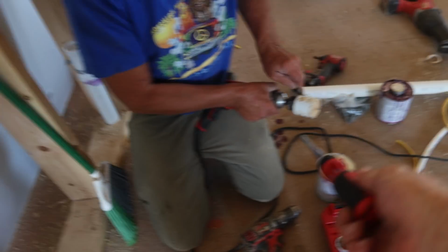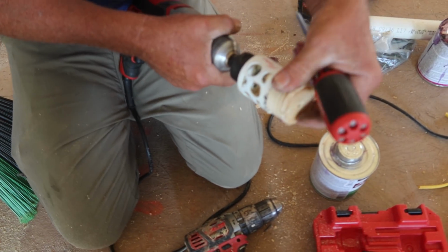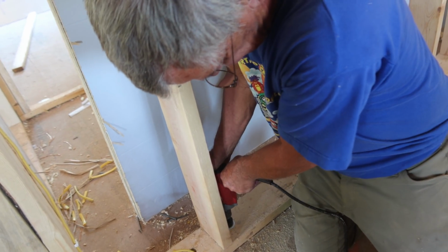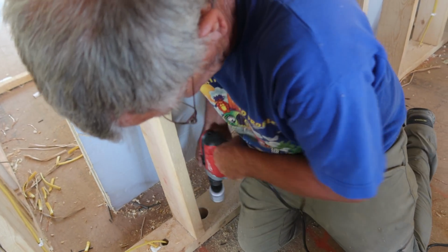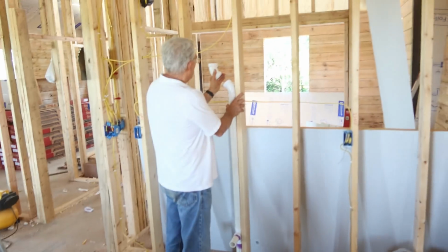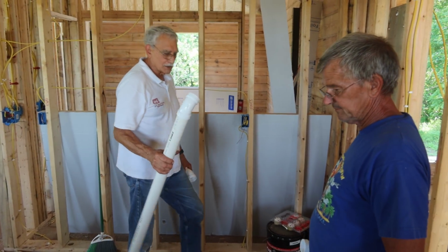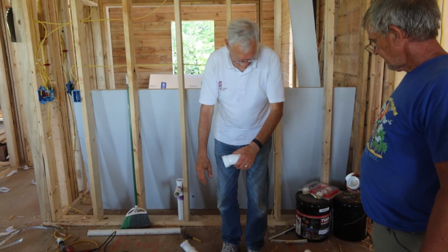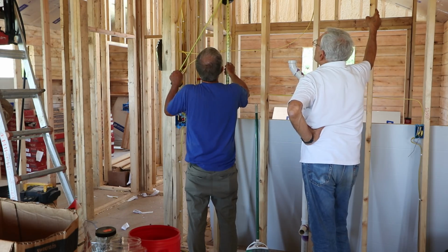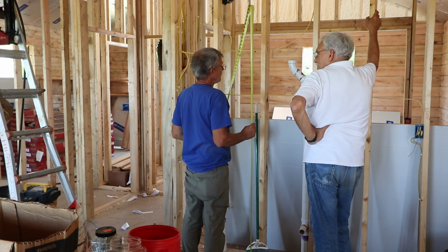I like the way that they've done that. Yeah, that's Milwaukee. Good job. Didn't even get any yellow on it. No mustard. I don't see any down here. That's what we like to hear. There's 2-inch pipe. Need some purple on it. Primer and glue, you know what to do. That light. You put this light at 7, didn't you? Yeah. Pretty sure it's 7. All right, 7.3, good enough. I always go by the ceiling from the bathroom, you go 12 inches below center.